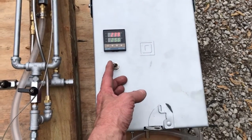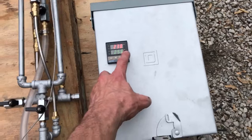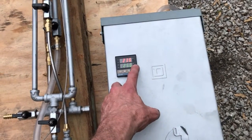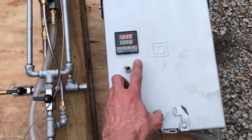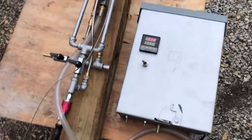Now to turn it back on, you have to flip this switch again. Once your process value is stabilized and you set your temperature five degrees below on the set value, you then have to turn this switch off. Let's go over that one more time.